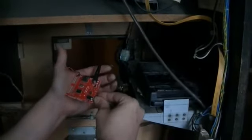You unplug the headphone jack. Again, this is an adapter to change it from mono to stereo. I bought this on eBay for like $3, and that plugs into the stereo jack on the WAV trigger board. Now you can cut these and rewire them yourself if you want, but if you don't want to mess with your setup, this is it. It's a plug-and-play solution. That is it.